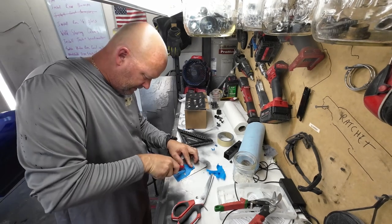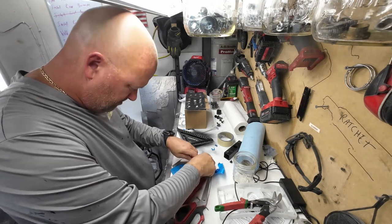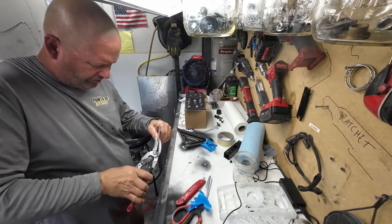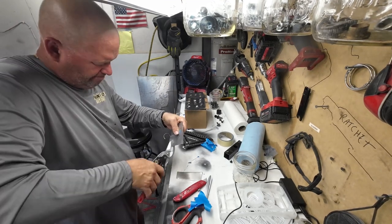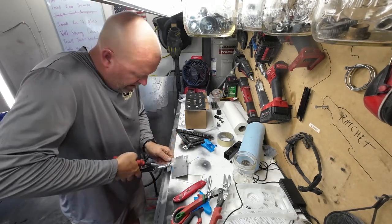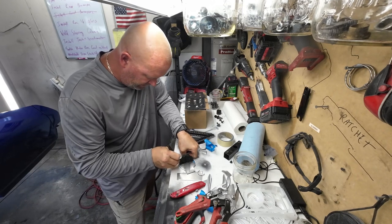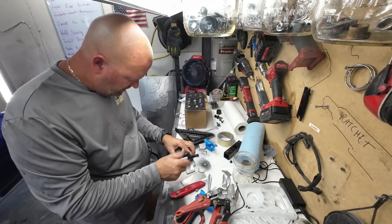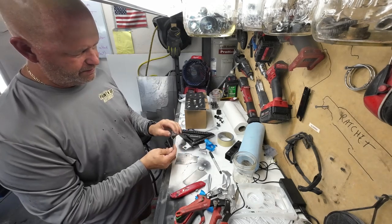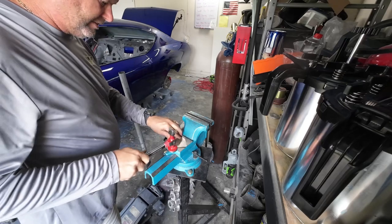Then set that on your piece of metal and mark around it. Some of this stuff I just cut because I wanted to make sure it stayed there — I figured the pen with my hand squeezing might kind of fade away. So use shears, trim it out. Run this line here, bend these over, and flatten this out just a little bit first.